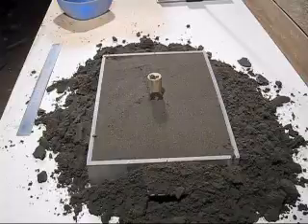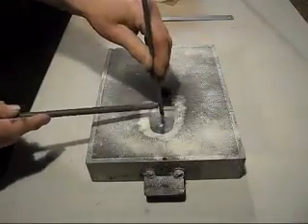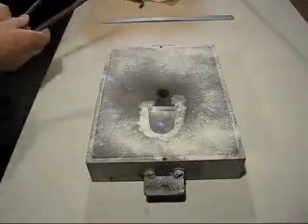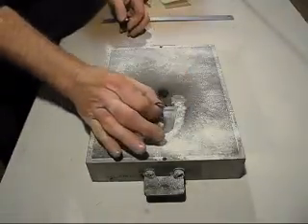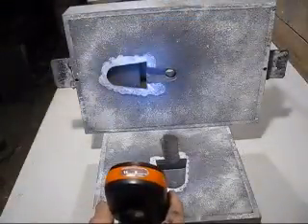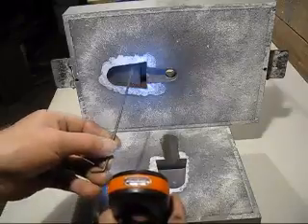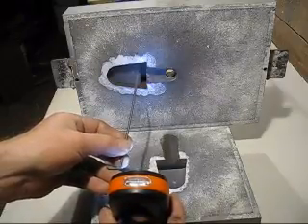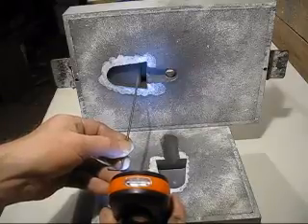There's the top half of the mould done — the cope — and there are no vents on it. Here are the two halves of the mould ready to be assembled. There is a very deep pocket where the air could collect, which would be the logical place to put a vent. But I'm not going to put one in there and we'll see how it goes.